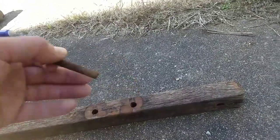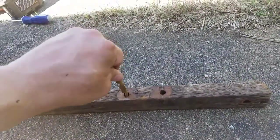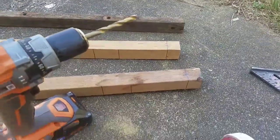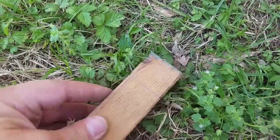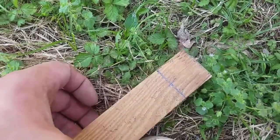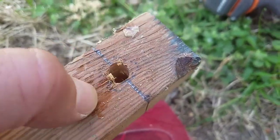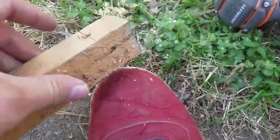It's a little bit bigger than 11/32nds, and if I need to go bigger the next one is 23/64ths, which is a little bit too big for these bolts, so I don't want to go too big. If you want to, you can mark both sides, drill a little bit into this one and a little bit into this one until they meet up - that way you know the outside of your holes are gonna be clean, and if there's any wobbliness in the inside who cares. That trick worked perfect. I did have a little bit of blowout but I drilled one side, flipped it over, drilled another until they met up.